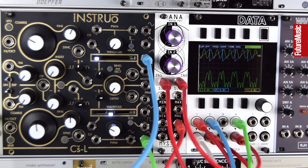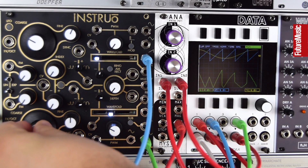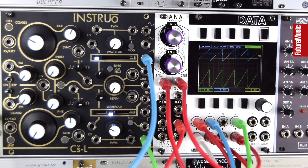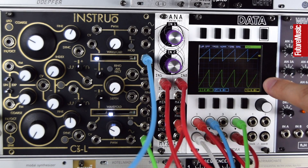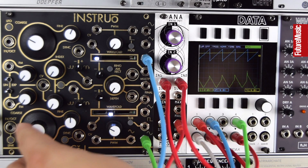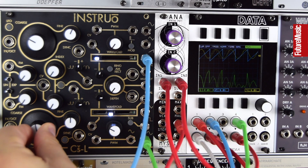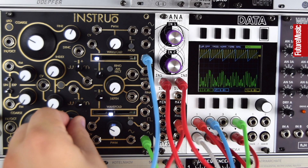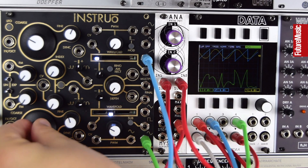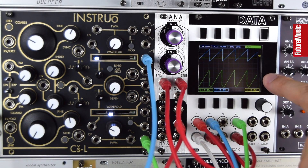In this patch we're going to explore getting PWM, unison, and 1980s super-saw-like tones from a couple of oscillators — one as an LFO and one as a standard VCO. I have a saw wave, which is the blue trace, and the yellow trace is an LFO. These are going to the two inputs, and the green trace is my output. You can see this LFO swinging this saw wave around. Opening up my low-pass gate so you can hear this fully, I'm going to play with the rates of the LFO. You can hear we can lock into some great audio-rate tones. We can also drive these inputs and clip and distort them as well.